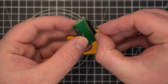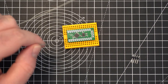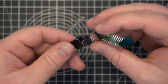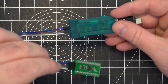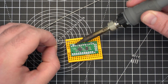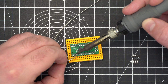Programming one of these boards is a little more complicated than programming an Arduino. You'll notice there's no USB port on this like you'd expect on an Arduino board. STM chips require a separate device called an ST-Link, which is this little green programming dongle. You plug the dongle into your computer and use the little header pins to connect it to the board — that's how you program the chip. This is more of the grown-up way of doing it. There are STM dev boards that have the ST-Link programmer built onto the board itself, but this is a very DIY module and I just want a simple little compute module I can plug into other things, so I'm perfectly happy to program it with the external programmer.